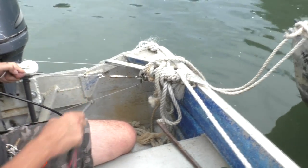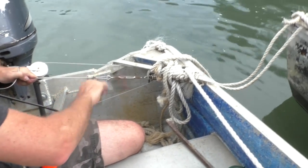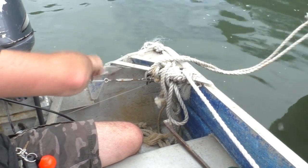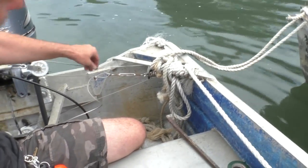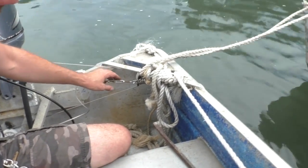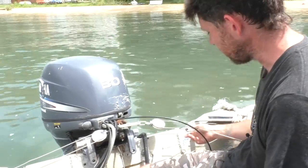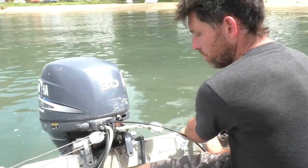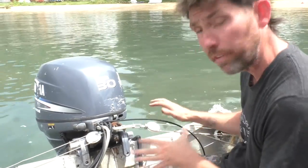Here's everything connected — we've got the spring to the turnbuckle, turnbuckle to the wire, to the outboard and then onto the helm. Now this has got a bit of tension on it and I'm making sure everything is still in its pulley and hasn't popped out of any of the grooves. I'll just do up the nuts on this little locking clamp. I'm going to do the same thing on the other side first, and then I'll look at the tension and whether I'm going to try and pull it harder or just use the turnbuckle to tension it up. I've got these reasonably tight now, and I'm just going to use these turnbuckles to put a little bit more tension in. You don't want them super tight, but you don't want so much slack that the cable can pop off the drum or any of the pulleys.